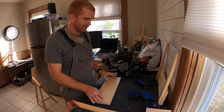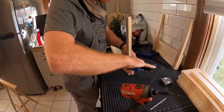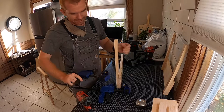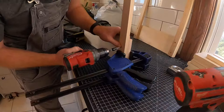I'm going to take one of the aprons — this should be a 17-inch part — and take one of our legs, turn this upside down, and use one of our quick clamps to hold it in place. We're going to make sure that's all nice and flush, and then take the other quick clamp and stack it pretty much on top of that one, to keep it from twisting as we go. Then we're going to drill into that first hole that we marked earlier.